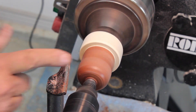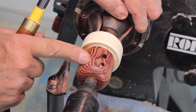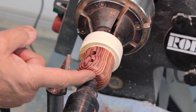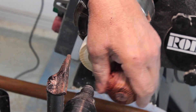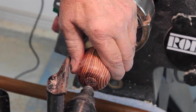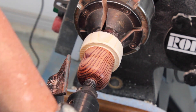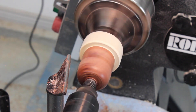That's a nice clean push cut, and I shouldn't have to start with any sandpaper less than about 400. Eventually I need to take that little bit of wood off at the very bottom where my tail center is up against. I don't want that little indentation in there. I can't do that right now until I glue it in, or I can use a different chucking system when I do that. A little bit more and I'll be done with this.